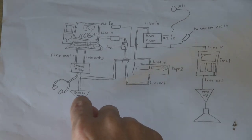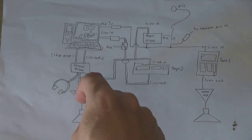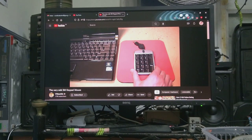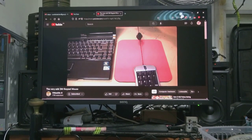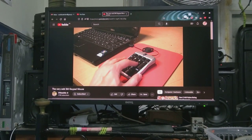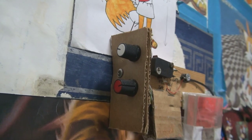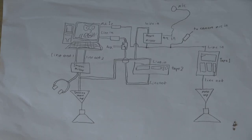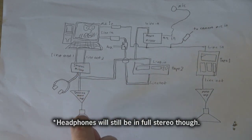You may have noticed there's only one wire and one speaker here. At the moment I'm using a stereo homemade amplifier to amplify the computer sound and send it into speakers. But because of where the speakers are placed, it sounds like there's more sound coming out of the left speaker than the right. Even if I turn the left speaker completely off, it still sounds like there's sound coming from it — only when I put my head right between the two speakers can I tell the left speaker's not doing anything. Looking at how I've got the sound level set up, the right speaker's on a lot and the left is barely on at all. So I might just as well be listening in mono at this point. What I want to do is make an amplifier that takes in the stereo signal, mixes it down to mono, and outputs it to a single speaker.